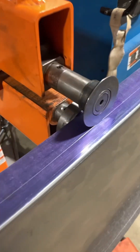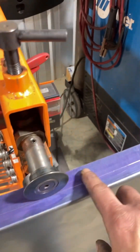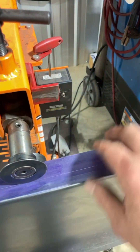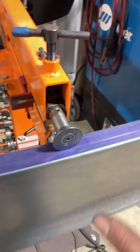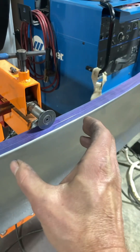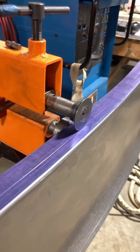So on this flange we're gonna slowly start turning it up, and going back over to the planishing hammer and relaxing this flange. If you tried to turn this up to a 90 it's gonna pull this panel in super tight and you'll be locked in, and it'll be garbage. Here we go.